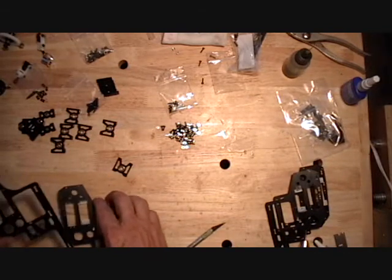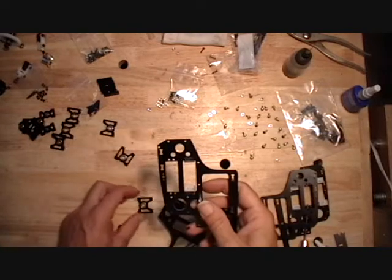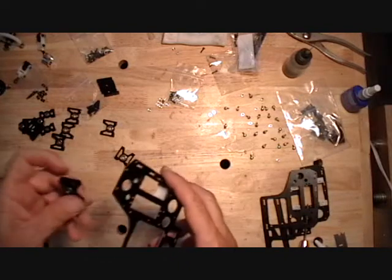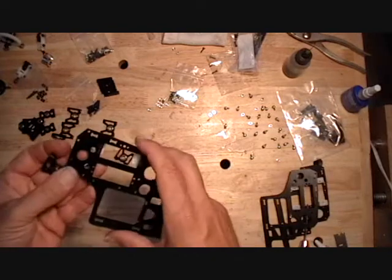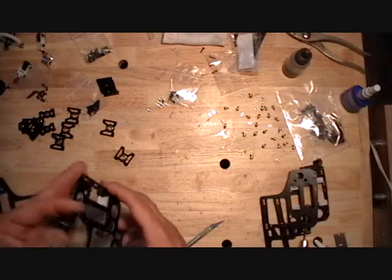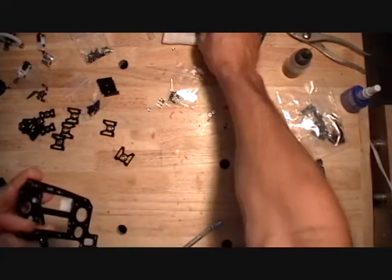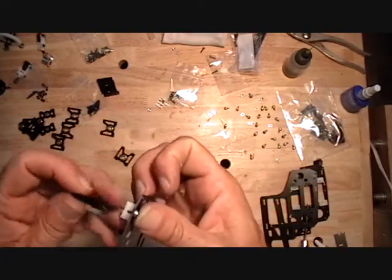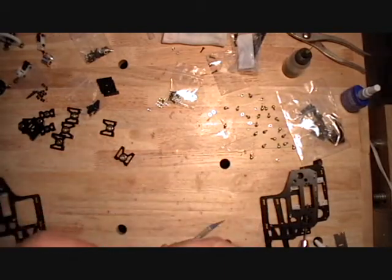Now you start out with the outer side frame. So we'll start installing the bearing blocks on the outer side frames. The bearing block, the deep V in the bearing blocks goes aft, and the top bearing, the bearing goes up. We don't tighten anything up until after we get to a point where we can slide the main rotor shaft in to make sure everything's aligned.